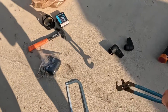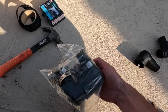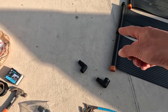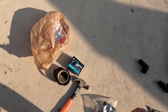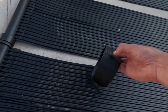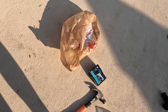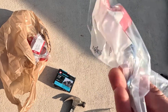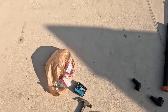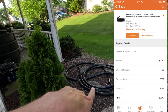You're going to need some type of saw to cut the inch-and-a-half pipe. It comes with two bags of hoses but for my configuration I only need one bag - I'm just going to run the water in one side and out the other, so actually only need two of those. I like to put straps around the coils and nail them down on the roof with roofing nails, and I got a whole bunch of inch-and-a-half u-hooks from Ace Hardware to further sturdy it and hook the inch-and-a-half pipe down onto the roof. That's the piping right there that we're going to use.